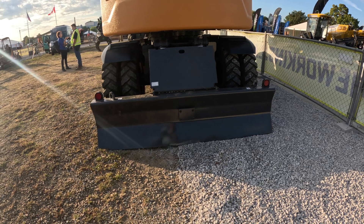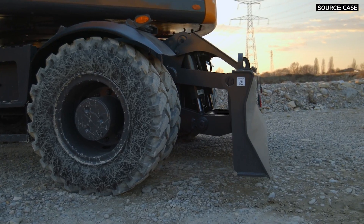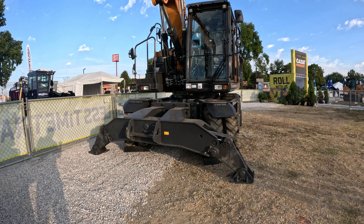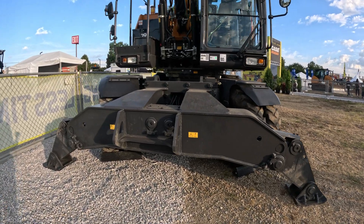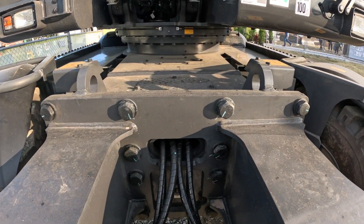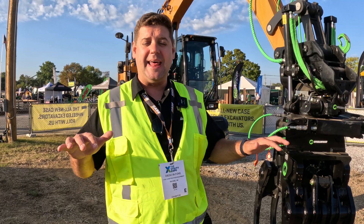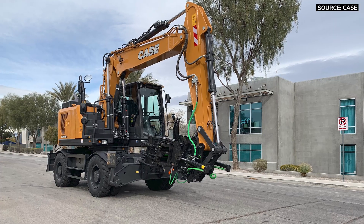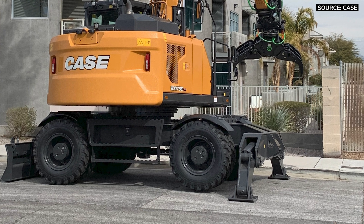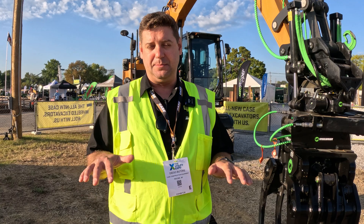You can configure the lower frame the way you want. We provide a rear blade as standard with all of them. The rear blade has a tow hitch functionality so you can tow a trailer, and it includes an electrical connector and a trailer dump line. In the front, you can go without stabilizers — especially on smaller machines like the WX140 or WX155 — to reduce the work footprint. On slightly larger machines you may add stabilizers to the front or rear for extra stability. Stabilizers remain within the machine width when up, then deploy outward sideways for added stability.